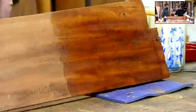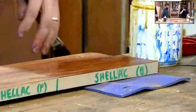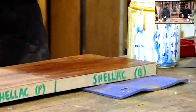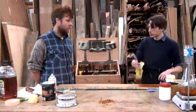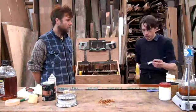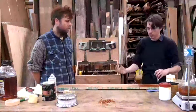And will you try and vary, start from this end the next time? I'll always go with the grain direction. When sanding and brushing, I always try and work with the grain, especially when brushing, because if there are any slight imperfections, they'll be hidden more in that grain.